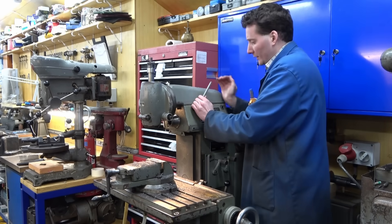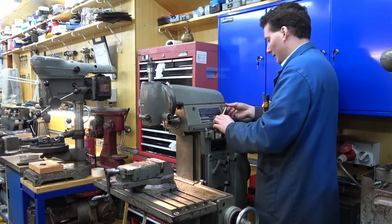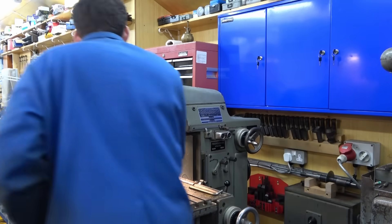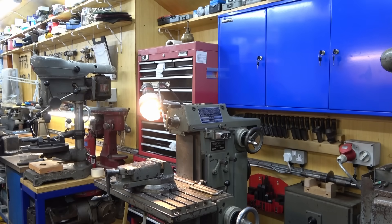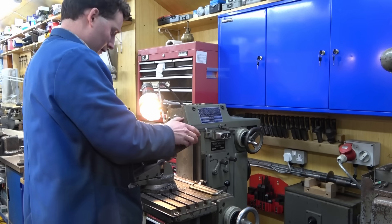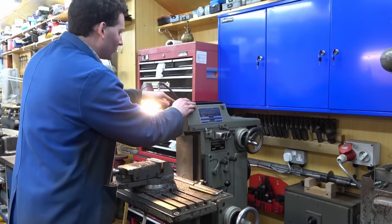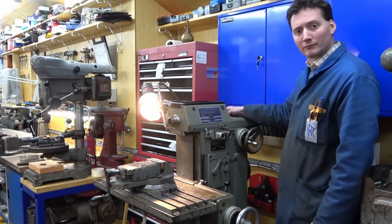To do this work I'm putting the machine into horizontal mode so I can approach everything with the cutter pointing that way. That's pretty straightforward on this machine — these two bolts just slacken off and the head slides down. In its place goes the horizontal protector to stop bits going into all the gears, and this now exposes the horizontal spindle with the drawbar at the back.